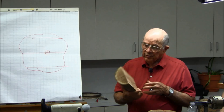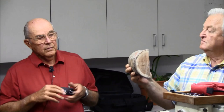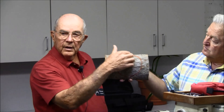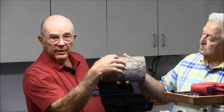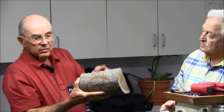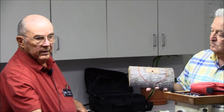If I'm going to do a natural edge bowl, all I do is cut the log straight through the center. If we want to keep the bark on the natural edge, we use a log where the bark is secure. Then we take it into the shop, use a router bit at the drill press to create a flat spot for the chuck — we're going to chuck it with a screw chuck. I mark my circle on it already, take it to the bandsaw, saw it out. Now the top of the blank is going to be the top of the bowl.